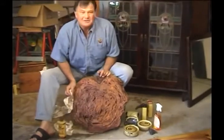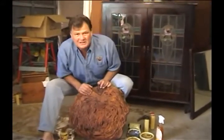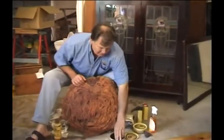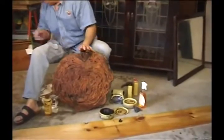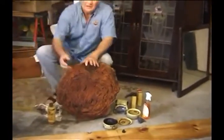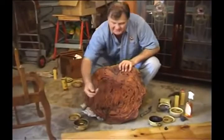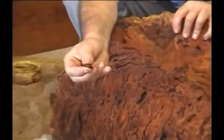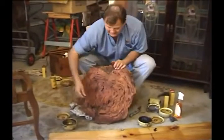But in this instance, I want to get this more dramatic. And more importantly, I want to fill some of these cracks. Some people would say you need a wax stick, or put some plastic wood in — well, no, we don't need to do that. Whenever you buy a tin of this product, you always take a little bit of it out, roll it into a ball and leave it somewhere, just like that. If you let that dry for a while, it'll come out looking like a little lump. That's what I have here — bits I've hung onto over time. That's a bit of not-so-coloured wax, but it is rock hard — probably not more than about a month old, but as hard as a rock. So you go from that soft piece, let it harden over a few weeks in the air, and it becomes like a rock. And with that, you can fill anything.